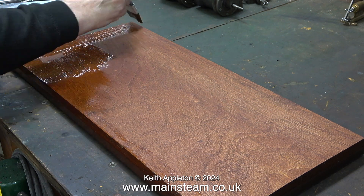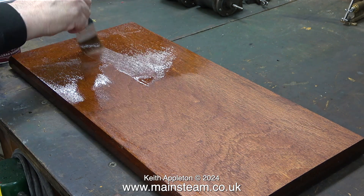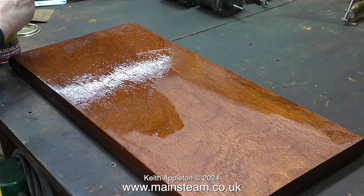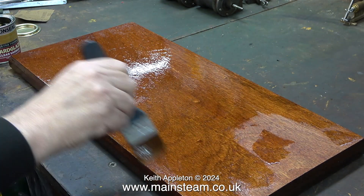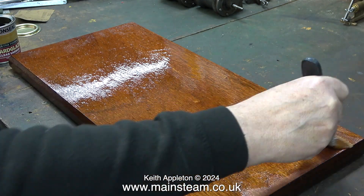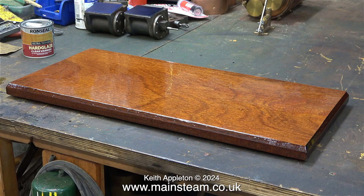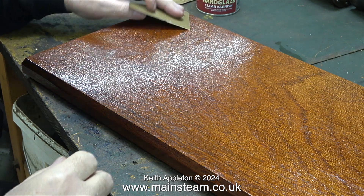All I have to do now is duplicate what was just shown in the video clip on this piece of wood. I'm assuming it's mahogany, but when I was sanding it I didn't get the familiar peppery sort of smell. I'm trying to give the board an even coat, and to start with it seemed okay, but then I ran into trouble — certain areas were not covering very well and the surface was patchy, with parts that looked dry. The video is running at 400%. After painting the board with the varnish I couldn't do any more, so I came back the next day — and when I looked at it, it was horrible, with dry, non-glossy areas.